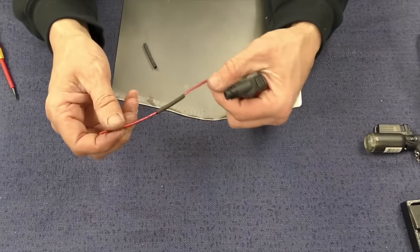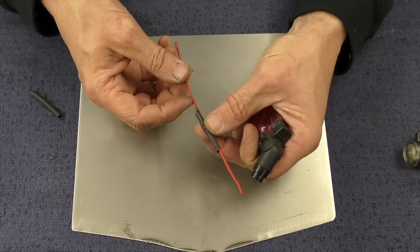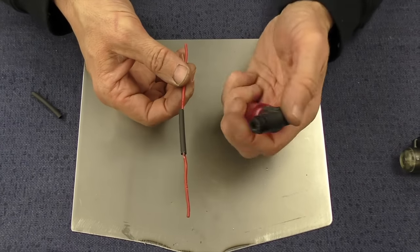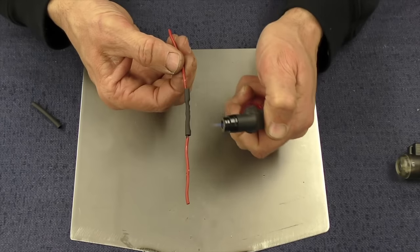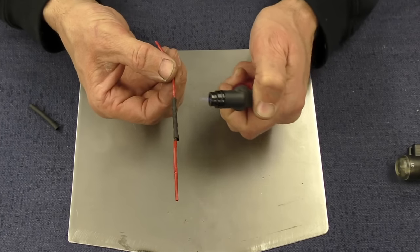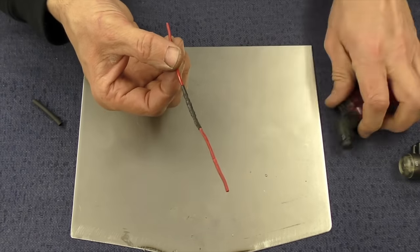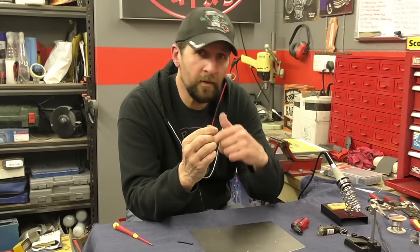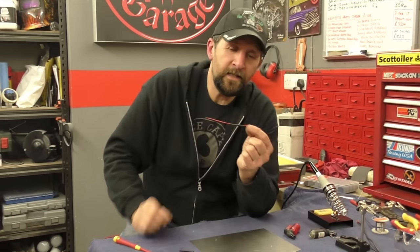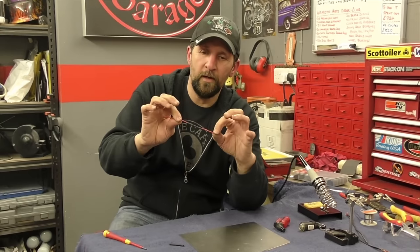Now take a lighter — this is about as simple as it gets. We're going to start in the middle and work away to each end. You're not looking to put the lighter flame straight onto it — come away a little, it's heat shrink, it just needs a bit of heat. There we go — job done. That's it. Now that joint will last a lifetime, it will last as long as the rest of the wire. What's really important is that it's no thinner than the original wire, because it will build up resistance. And it doesn't need to be any thicker — so you've got a nice tidy looking joint: two pieces of wire joined together permanently forever.